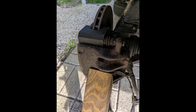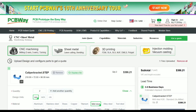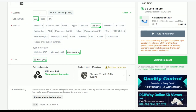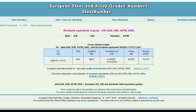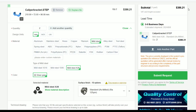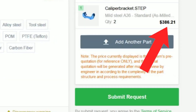I've seen a lot of YouTube videos getting sponsored by PCBWay so I thought why not try and get a quote for CNC machining. So I went to their website and started adding my drawings and materials. I chose mild steel which is called S235 in Europe. The originals are cast iron. It's not even threaded yet and the site has already quoted $386.21 per part excluding VAT. The disclaimer also stated that it has to be reviewed by an engineer and assessed by complexity, so I expect the price to go up after reviewing.